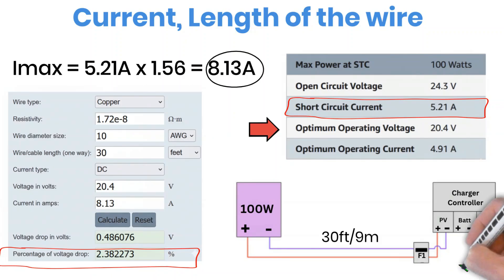It's also a good idea to keep your charge controller as close to the battery as possible. This helps reduce energy loss and also saves cost, since you'll need shorter, thinner cables for the low voltage side.